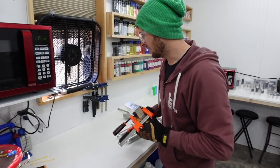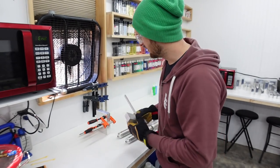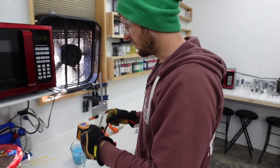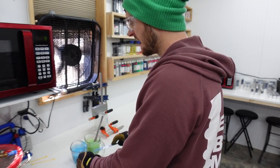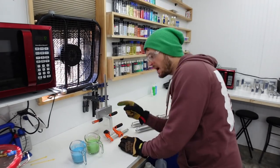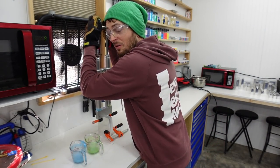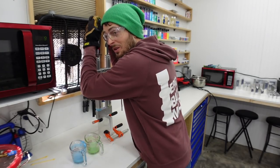Look at our mold - that is the top of the bait, and this side is the belly of the bait. So you know which color goes on which half mold and how to orientate your mixing block. We want to go across this way, and our top is on our left side - that'll be our blue. Green is at 333 degrees, blue at 332. We're going to go ahead and shoot - bottom green, blue on top. Get our injector.